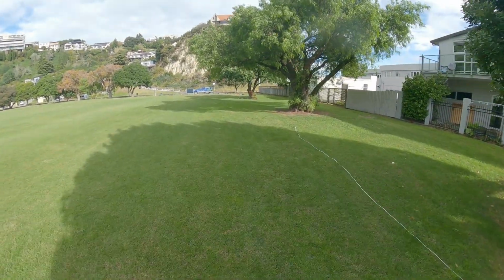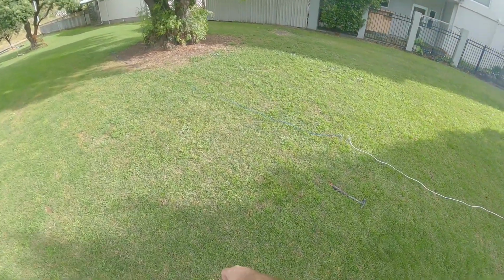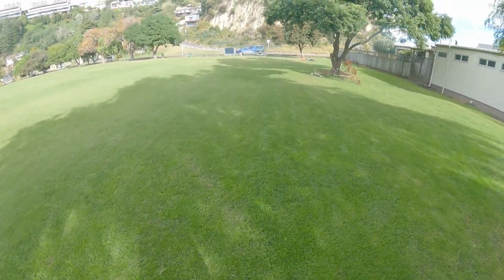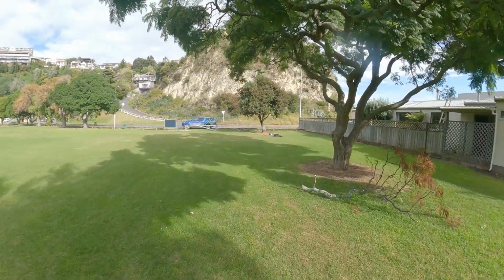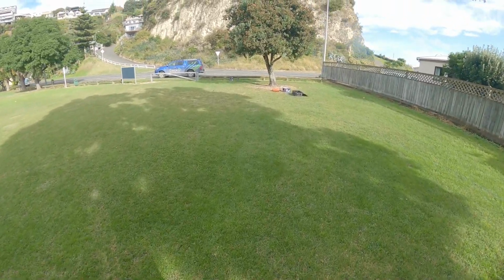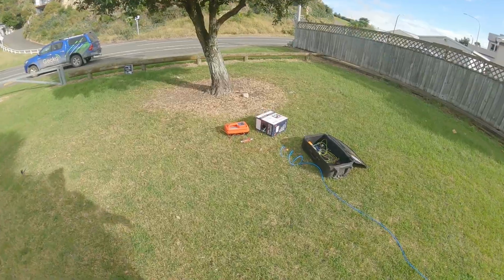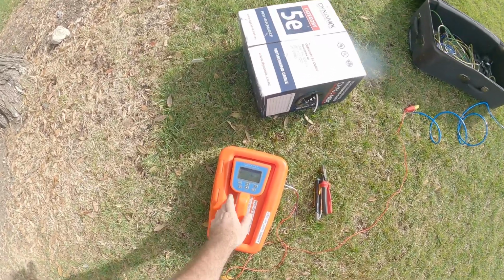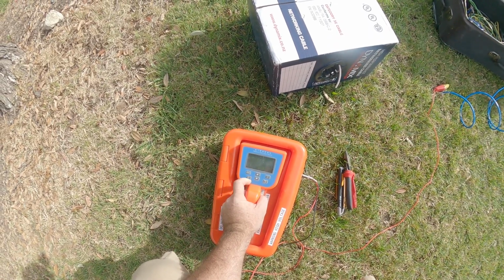Well, actually, not really, because if I have to find a fibre cut, that's a bit annoying. That makes that somewhat more difficult to detect. I like the instant drop off actually. So I think you guys that are locating underground pipes would definitely be keen on a jump across, but for me, I'm trying to find a broken fibre cable and work out where the break is without having to go through the process of the OTDR, and yeah, that's quite cool. Well, for you guys. So let's try 7 kilohertz.